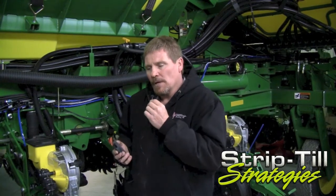One of the things we're looking at with strip till now, when we get back in the field, is actually offsetting our strips somewhat with each pass. We strip till 12 rows and plant 24. Normally we use our RTK to have 30-inch centers with sub-inch accuracy, and we're going to change that a little bit where we leave a wider gap on each pass. What that will allow us to do is when we come in and plant with 24 rows, we will be planting off to the side of the ridge or side of the strip a couple of inches.